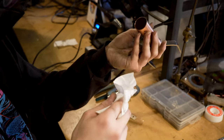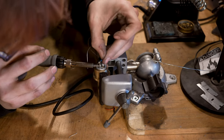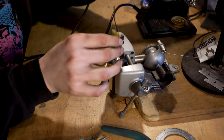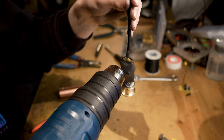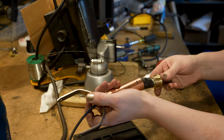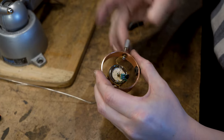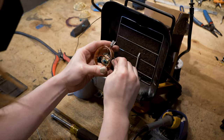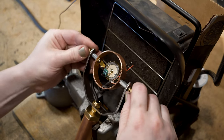To begin the final assembly, we prepare the bottom of the body and begin soldering the XLR components. Capacitors and ferrite beads are added for RFI protection. A cable is added to the circuit board that will connect it to the headboard. Insulating tubing is placed over exposed parts of the cable and electronics and heat shrunk in place. The cable and board are inserted into the mic body and fastened into place. The headboard is wired to the capsule, placed in the capsule holder, and secured to the head ring. The end of the cable is stripped and threaded through the rubber gasket in the head ring. The head is secured to the body brackets and the wires are attached and soldered into place on the leads of the headboard.